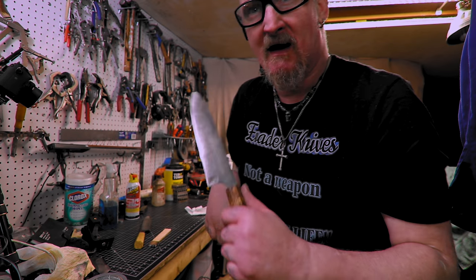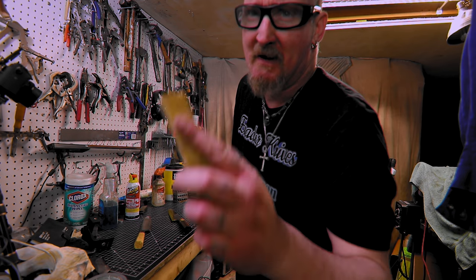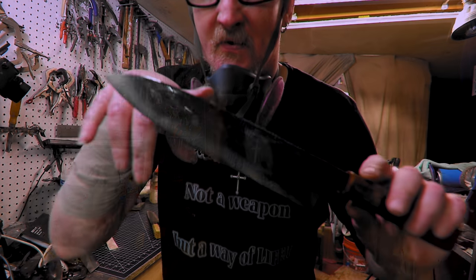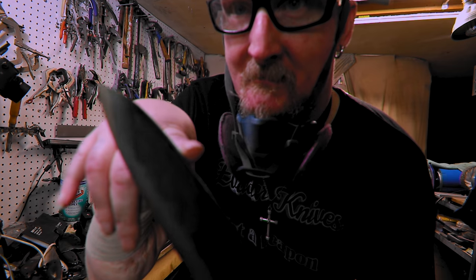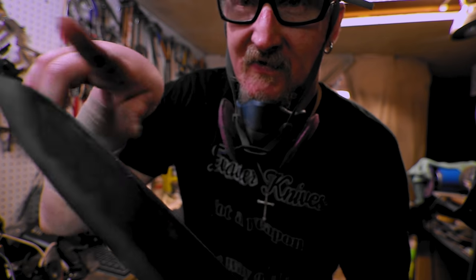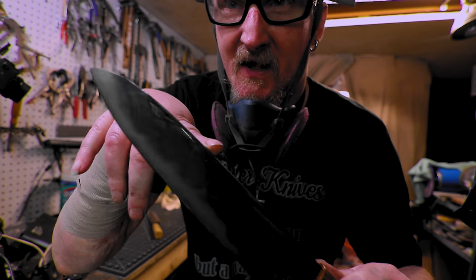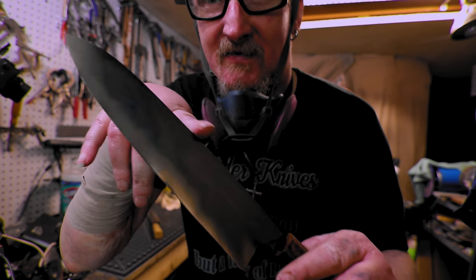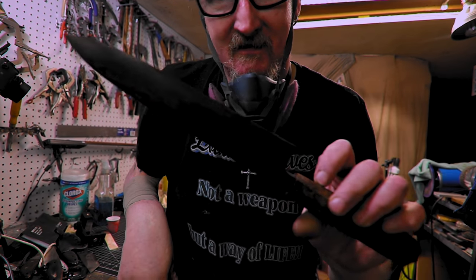All right, let me get some sandpaper, and then I'll come back when I show this. Not sandpaper, let me get some sawdust. Can't speak. Woo! All right, tragedy averted. We got the tip all nice and cleaned up. You know, I put penetrating oil, and I even did the spine with ferric. I just took a paper towel and wiped the ferric on it, and then hit it on the buffer again. That's it. No more etching and all that stuff. Just the spine. So, boom, this one's back on track and just needs sharpened up.